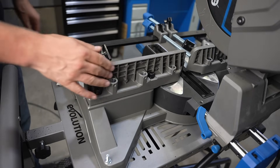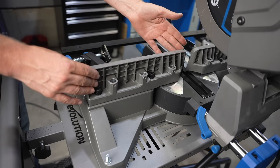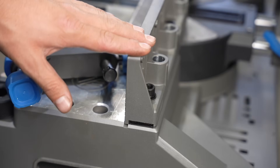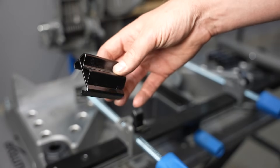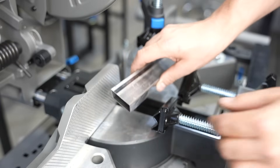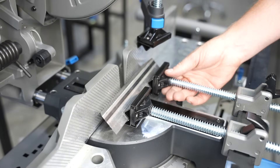While we're back here, take a look at the fence — they've added a whole lot of additional ribbing on this version of the mitering chop saw to increase the stiffness so that it can't deflect or bend. You can see right here on the end of the fence a steel bar that runs all the way through the length of the fence on this newest version to keep it from flexing out by the blade. Three v-blocks are also included to install on all of the different clamps for holding round stock, or they can be used to position square stock up at a 45-degree angle, which is actually a little bit easier on your blade for straight cuts.